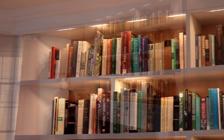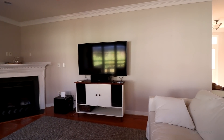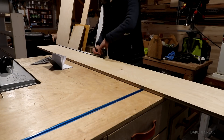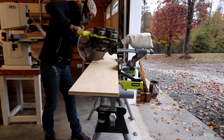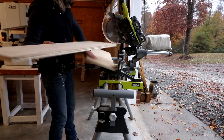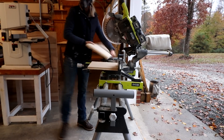So now when I have the bookcase over the fireplace more or less completed, it's time to start building the wall units. There are going to be three units: the left part, the middle part which is above the TV and has a stereo integrated, and then the right side. I'm building rather basic bottom units here using plywood and screws, nothing fancy. Later on I'm going to add dividers and shelving as well.